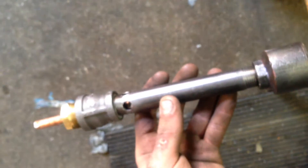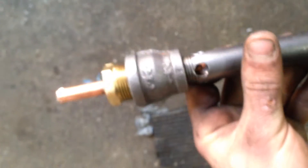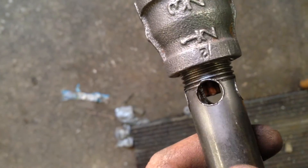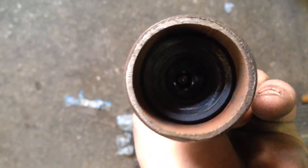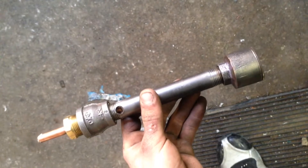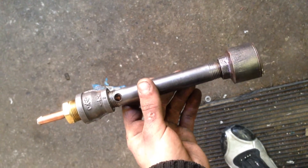And then I also made this little tiny guy. It's made out of a half inch gas pipe, a three quarter to half inch reducer, some fittings, and a piece of copper that runs through with a hole drilled in the end of it. Propane comes through there and blows a flame out the end. This one's probably about 50,000 BTUs.